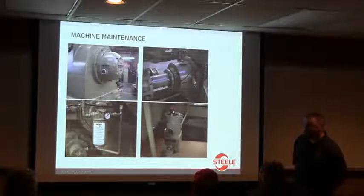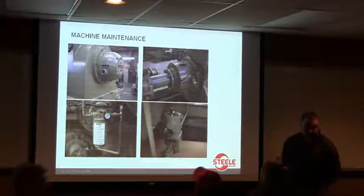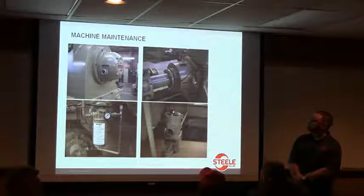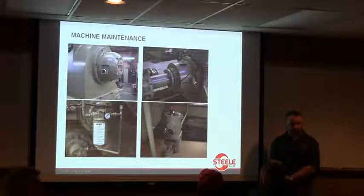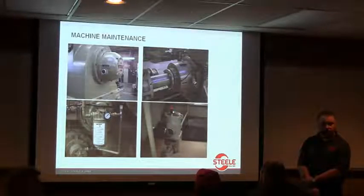Is it necessary for it to be pressurized? I think it just creates pressure. Let's think about what happens. When you start operating the machine, the gears pull oil out of that when everything starts running. It just naturally generates some pressure in there. Once you pull the oil out, there's no way to release the air in that cavity if you don't have that pressure relief on there. I think there used to be vent valves under there, but if you don't release that, it just won't let oil come back up into the sight glass.